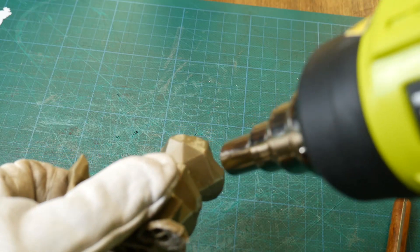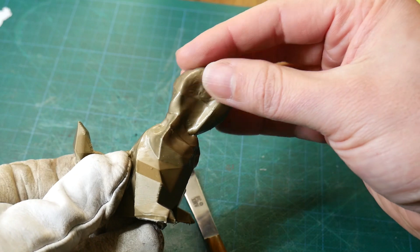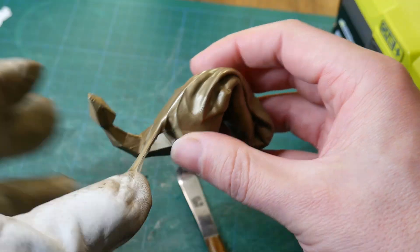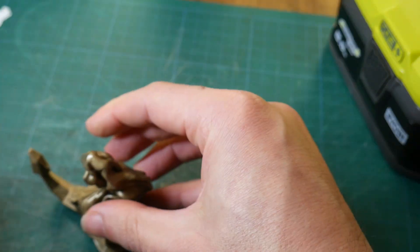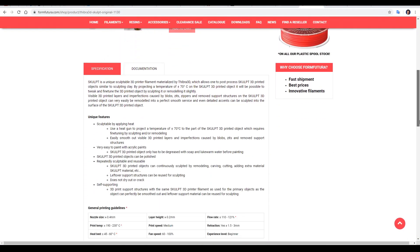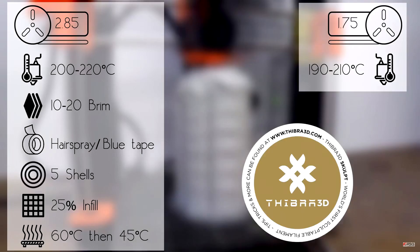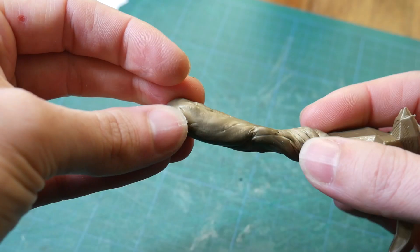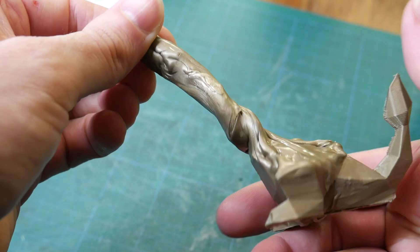No turning back now, so I applied some more heat to discover just how pliable it was. The answer was very, and I also discovered I didn't need the gloves — in fact they were more of a hindrance than help. My first test was done and it ended up looking like a mess. It was at this stage that I went to the Form Futura website and discovered their printing guide video. I had most of the settings correct but the two that were sadly lacking were the five shells instead of three and the 25% or higher infill. I'd approached this like a typical PLA print and when it gets really hot there's just not enough heft in the model to prevent total deformation.